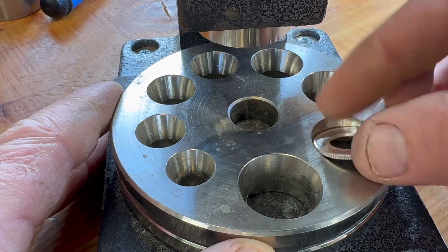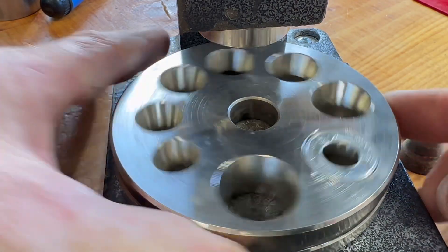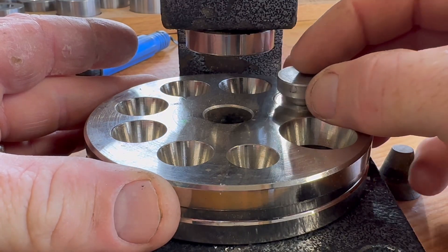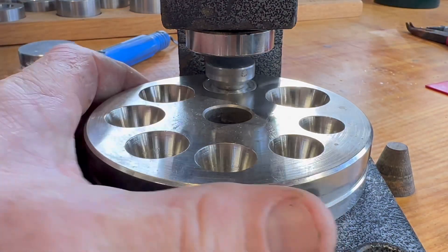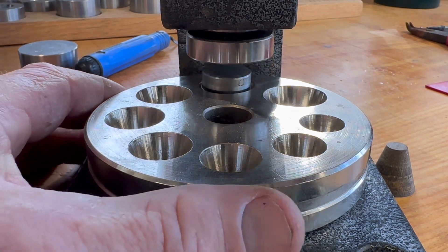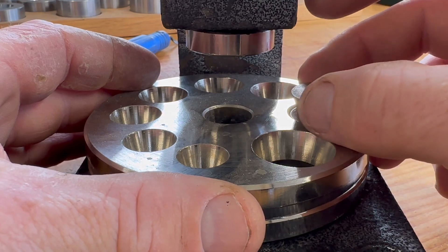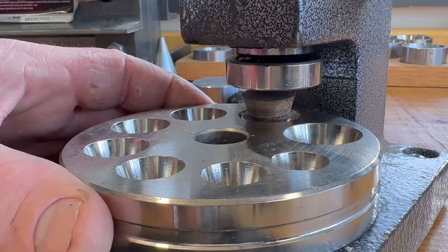So we're going to find the die that it barely fits into. We'll put it under our plunger and then use our Jason's Works starting cone — this is going to get the hole started. We don't want to use it all the way to the bottom because it'll mar the coin up, so we're going to switch it to a composite cone and press this one all the way down.